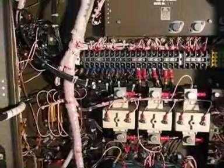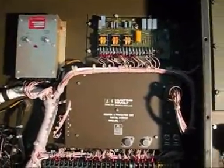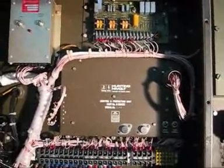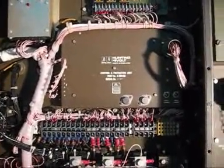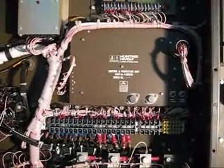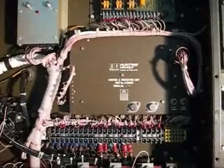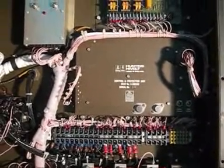So that's it in a nutshell — a very complicated way to control the generator. I think it would be much easier to do it mechanically, and it would be more reliable as well. So that's the inside of the Hunting HiVolt 14 kilowatt three-phase generator. Runs at 1500 RPM and can be run in single phase, 50 or 60 hertz frequency.